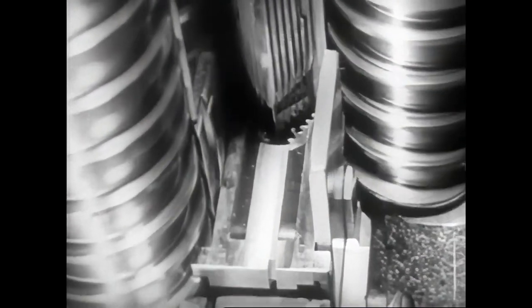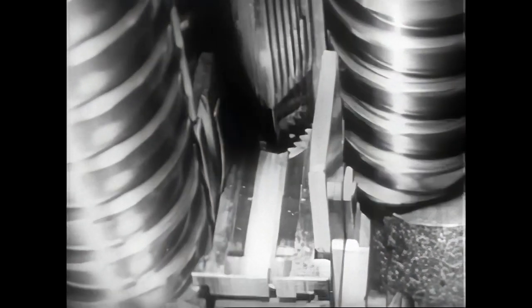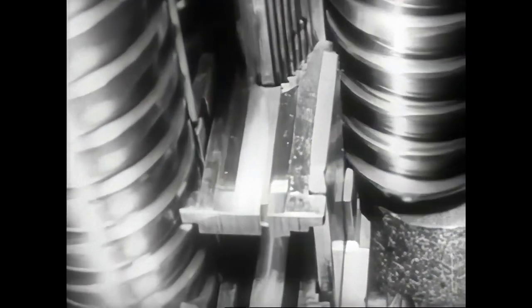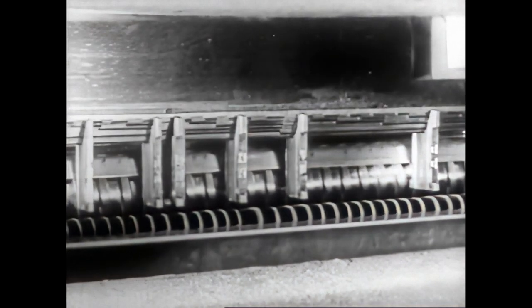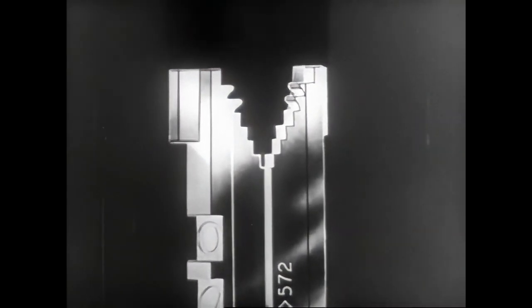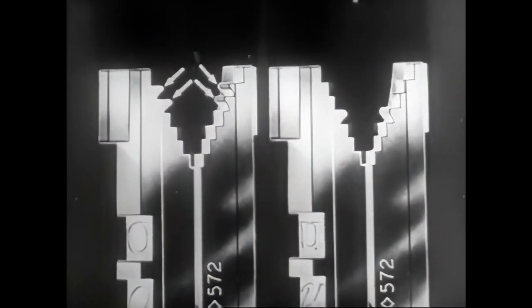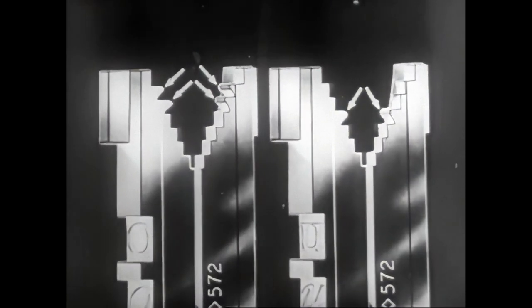To keep the mats suspended up to the moment of their release into the magazine is the function of the distributor on which they glide, suspended by their combination teeth. Every mat is therefore supported on the distributor bar by means of its teeth, as we can see here. For example, the mat of the letter O will remain suspended on the bar with the second and third tooth combination. This other one, however, corresponding to the letter N, will remain suspended with the fourth tooth combination.